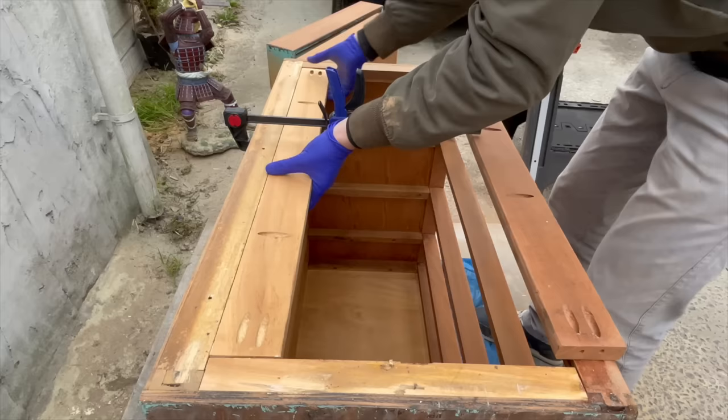And then I use my palm router with a carving bit and a guiding fence to deepen the groove that was between the piece of hardwood and the plywood on the side of the dresser. This way I was able to create an inlay with some super glue and a piece of brass. Purposely, I didn't make it flush with the side because I wanted it to be visible from the front.